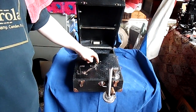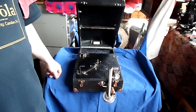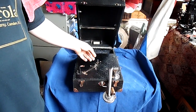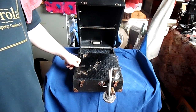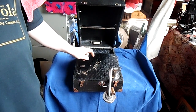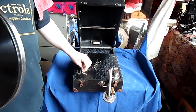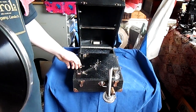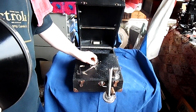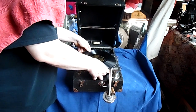This machine has a feature in common with the Lido — the speed indicator. It's the same arrangement: two screws attached to an axle attached to the friction pad of the governor. But with this machine every bit of metal is tempered and hardened, whereas with the Telefunken Lido it's not hard metal. So every time you turn it — after 10,000 times — you wear and gouge out the metal rod, and eventually your screws are all the way in and it doesn't work anymore. That's exactly what happened to my Telefunken Lido.